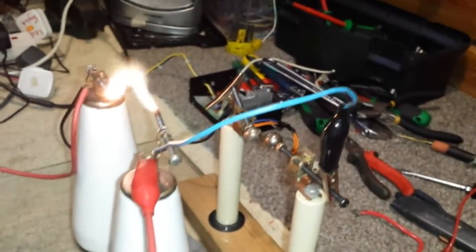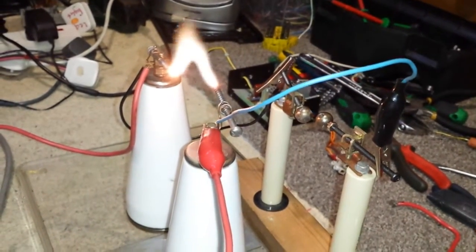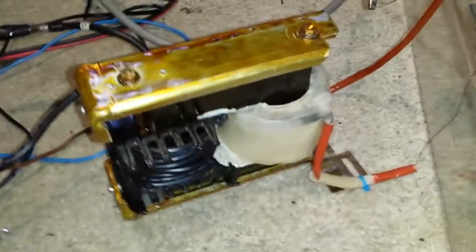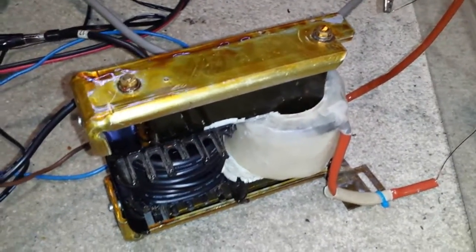There's a spark gap just in case the arc breaks - the last thing we want is an open circuit, especially running it on an IGBT, it would most certainly flash my windings. It may or may not, but just to be on the safe side.